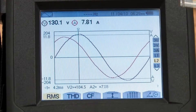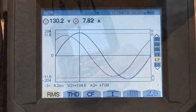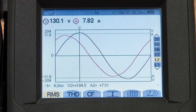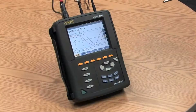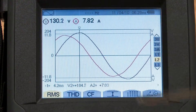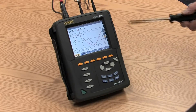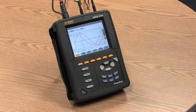If I go back to the screen mode, there is a screen capture feature. Simply press the screen capture button and now this screen is saved into memory — we can save up to 50 screen captures into memory. The sampling mechanism for the Model 8335 is such that we sample all eight inputs at 250 times per cycle, so we get very good trace fidelity and very good reproduction of the signal.